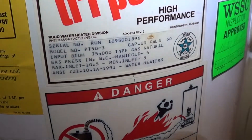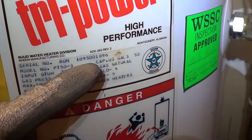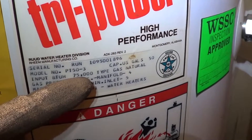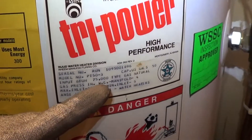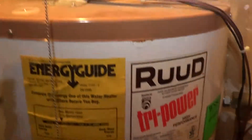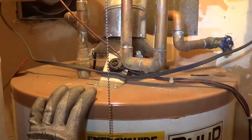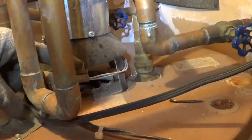This is a top floor. This is one of the original conversions from 1995 and it's 75,000 BTUs. Originally this would have had 40,000 on the top floor which would have been way too small, but there are no direct vents which are 75,000, so they had to use a regular natural vent which you can see right there.